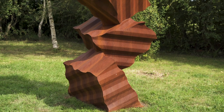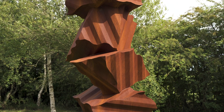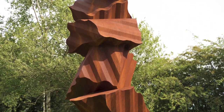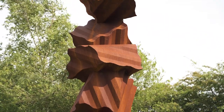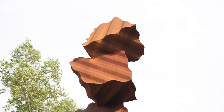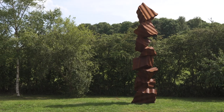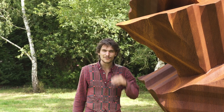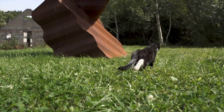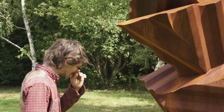I came to the conclusion that I would need an enormous piece of stainless steel tube to run the entire way up the inside, so this meant dismantling each element one by one and passing this enormous piece of stainless steel tube up the inside. Unfortunately, it's not a straight line up through there, so this meant cutting it and crooking it and shaping it all the way up through, and this was a process of a couple of months. It was also necessary, for the sake of longevity, to fit an enormous thick piece of Cor-10 on the base, and it actually continues up the sides of the base for about four inches, blended in completely seamlessly with the thinnest sheet above. You can't see it at all — and that was about three weeks' work.